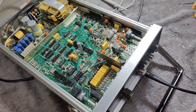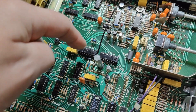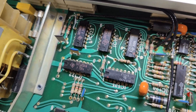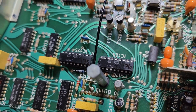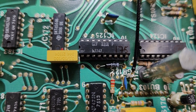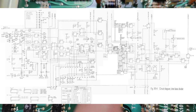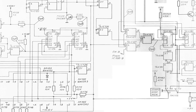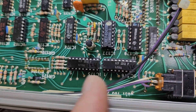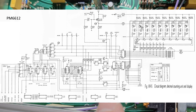So the problem is, of course, in the time base. And we've got some really special parts in the time base — the rest is just normal TTL gates, but here we have some really special counter divider chips called GZF1201P. I believe it's a 4-bit programmable counter, but they're also very, very fast. There is a reason why they use them both in the time base and also in the input stage of the main counter. One of them doesn't work — it was the first of the time base chips that was not working.